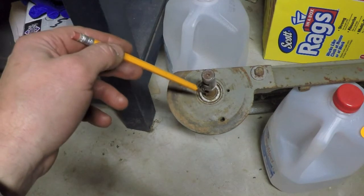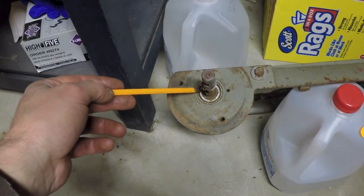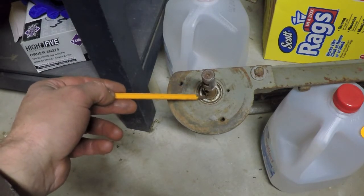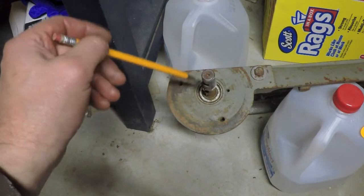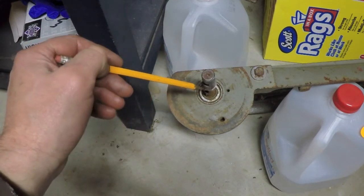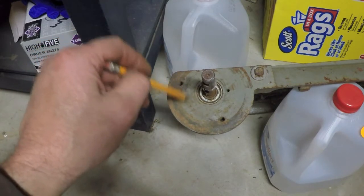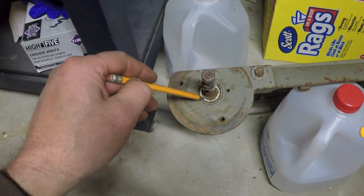it's larger than that. We get a snap ring right here that's out of position. It used to ride here. It was out of position when I got this thing, which makes me think somebody was already taking this apart. So I don't know if they had planned on replacing this bearing, because that's what this snap ring does. It helps retain this bearing, or what was going on. So I know that the hole is going to be large enough to accommodate the bearing, the snap ring, and quite frankly, it may have even been a situation where they had envisioned that this could actually stay on the machine for the bearing change. I think this hole might have even been large enough to accommodate this bearing.